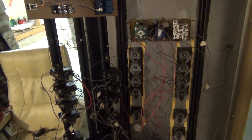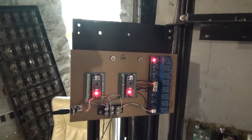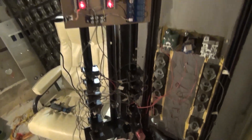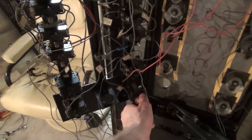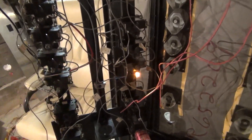Now we have the controller mounted and it's time to begin with the wiring. I first hooked up the stop switch so that when you activate it, you can turn on the controllers. When I pull the stop switch, the two microcontrollers come on and the relay board turns on. At this point I need to start hooking up all of the buttons and the button LEDs to the microcontrollers. A couple of buttons are hooked up and I've also hooked up the LEDs so I can test this out — when I turn it on and push the button, you can see that it lights up.